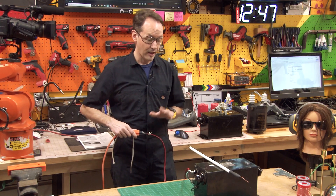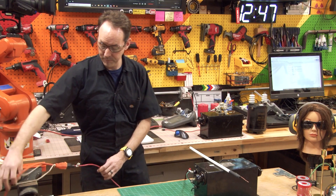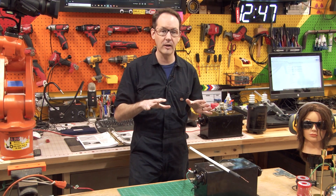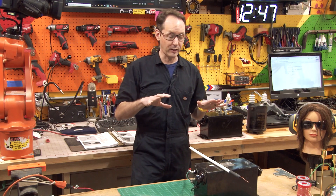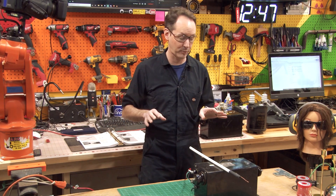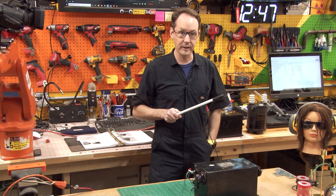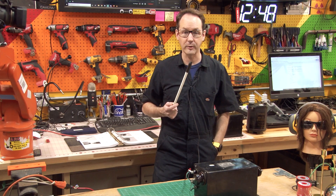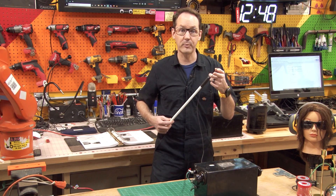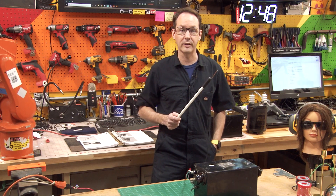Our system is now hot. This is exactly what you want. It's weird because there's 12,000 volts happening here and it doesn't make a sound — probably just a little hum. Aside from a tiny hum, it shouldn't make any noise at all. If it's making a static or crackly sound, immediately unplug it — it's probably about to emit magic smoke. So we have a hot system. We put one hand in our pocket and with the other hand grab the lead. The cool thing about the way we wired this up is that because this is connected to ground, you can touch the end and it's totally safe. This should be grounded all the time. Some people test by hooking this to the hot side and touching it — that's dumb. Don't do that.